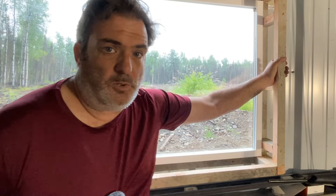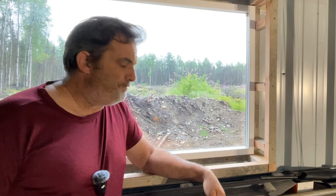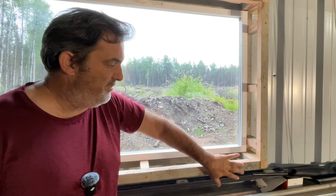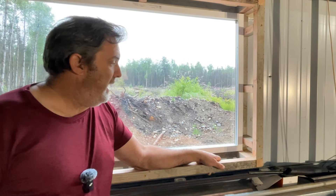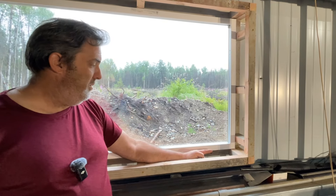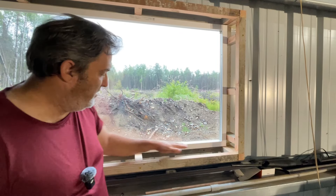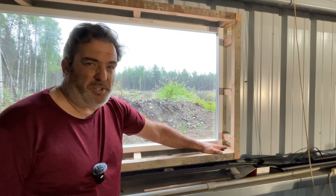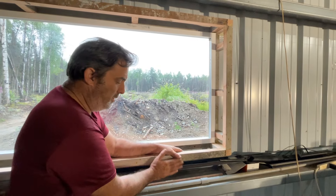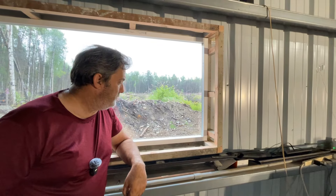There is a little bit of flex left. Once I get the building foamed, I'll clean everything up and redo my electrical a little bit. Then I'm going to do some plywood sheeting along in here, which will fasten into these and make them rock solid. The foam will build off the wall and come up around it, with furring strips going across the inside — maybe three-eighths to half inch thick — building it out so everything will be solid and closed. The plywood will come up and close off everything about six inches over the top girt.